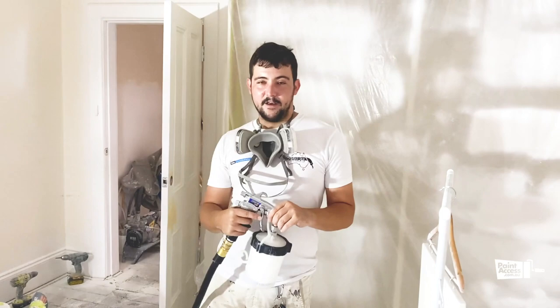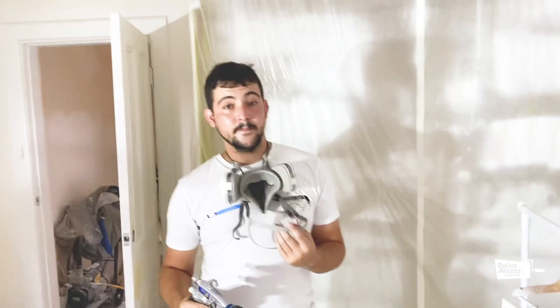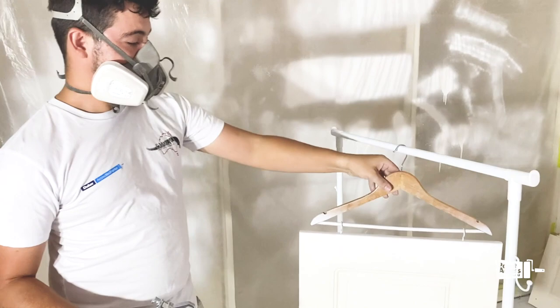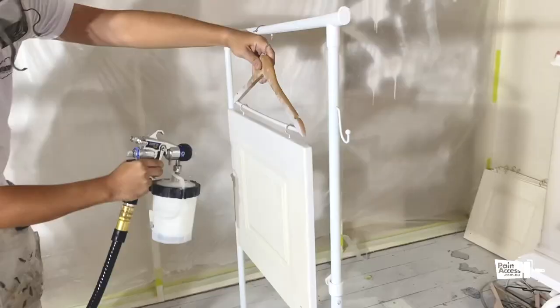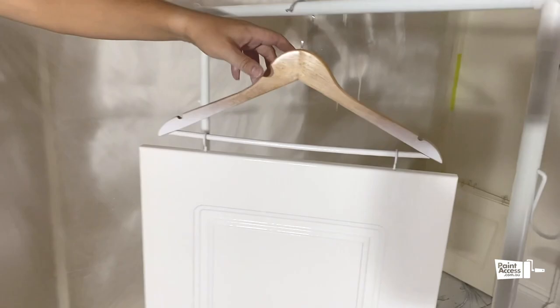Alright, I'm going to do another setup that's more professional — you need a bit more experience. We're going to go up to around 4 on the paint and pretty much full on the air pressure. That's a bit quicker and more productive. And a question: when you do edges, what do you do? Just turn the sprayer around so you can get a better angle to the inside — without changing pressure. That's an amazing finish, thank you.